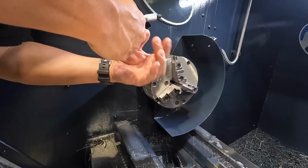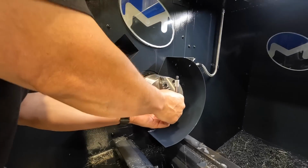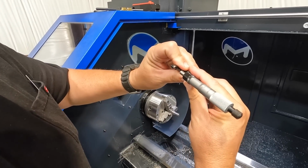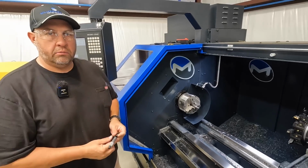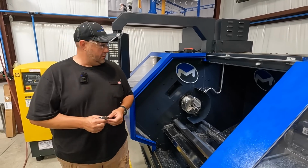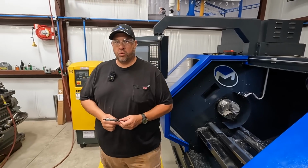I mic that. And we are at 591 and 5/10 right there. So we're spot on. What we wanted to finish that journal at there, we should have just a little bit of interference. So maybe we can warm that gear up and slide it on there. So this is good. It's working out great, man.